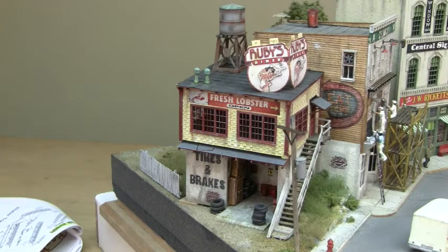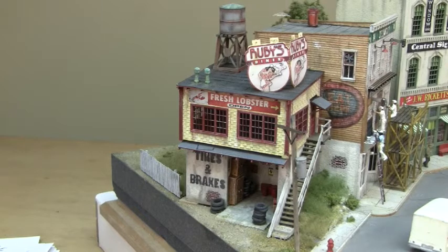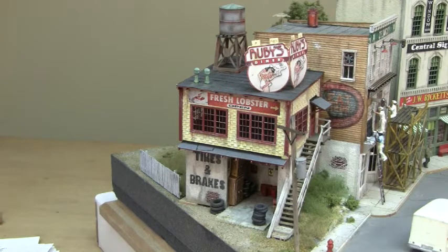By the way, there's something interesting about the corner posts there, Jack. Those are actually overlaid, which is unusual, because what we did was put the shingles on, then used a surface-mounted corner post. That's not really a corner post. They're one-by-threes, and there's one on each side to create the corner post.